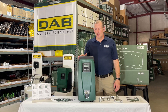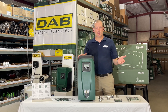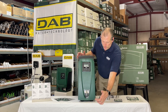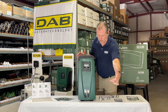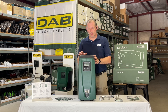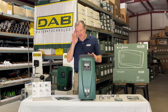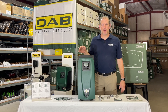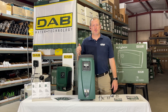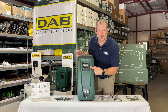It is self-priming, so if you're using a water tank or if you have city water pressure coming in, you will set it up so the water comes in. If it's a water tank, you simply open your ball valve and the water rushes in, and this pump will then send the water out the side to your point of use. Anytime you open a valve that allows the pressure to drop in the pipe, this pump is going to turn on and give you the amount of pressure that you set on the dash on the front.